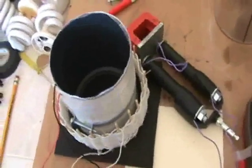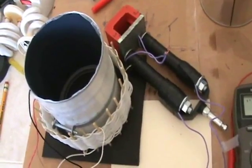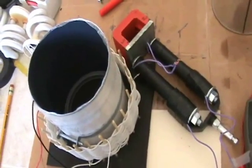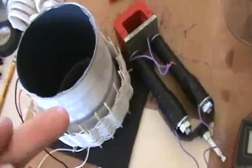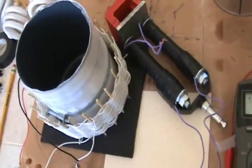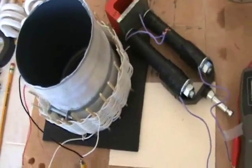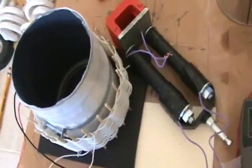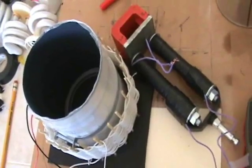Not a lot of people have dabbled with magnetic amplifiers, but maybe we should re-examine them. If you think about the Bedini SSG, it is really a clever magnetic amplifier combined with an amplifier motor, because you have this regenerative oscillation happening. With a magnetic amplifier, you can create a degenerative or regenerative effect depending on the flux you're creating in the metal with a DC bias — controlling gain by inserting a spin in the metal always in the same direction. People would do that with DC current, turning AC into DC using a bridge or half-wave rectifier. You can look it up in older basic electronics books under magnetic amplifiers.